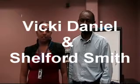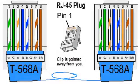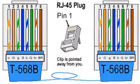And we are here to demonstrate the RJ45 crossover cable. The crossover cable, as the name implies, is a cross between the T568A and the T568B. The A standard color code is white green, green, white orange, blue, white blue, orange, white brown, brown. The B standard is white orange, orange, white green, blue, white blue, green, white brown, brown.